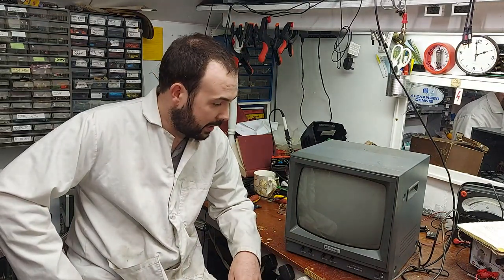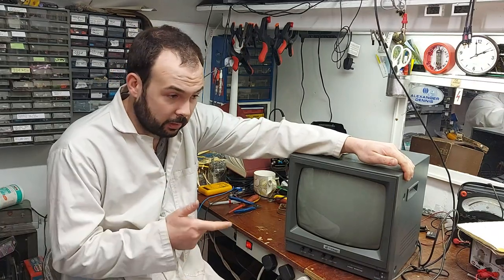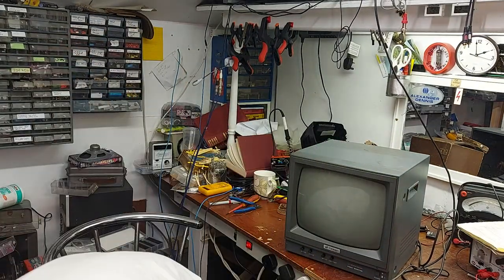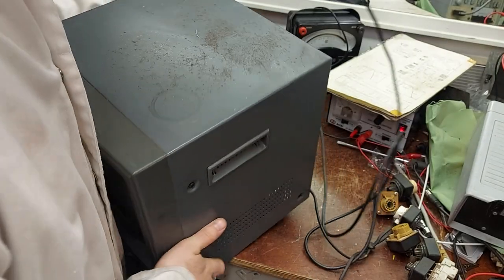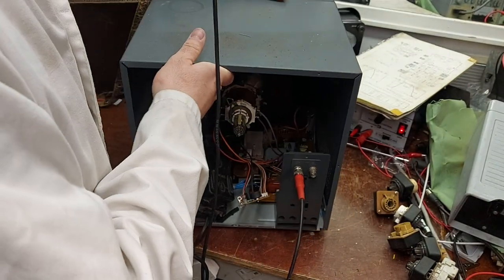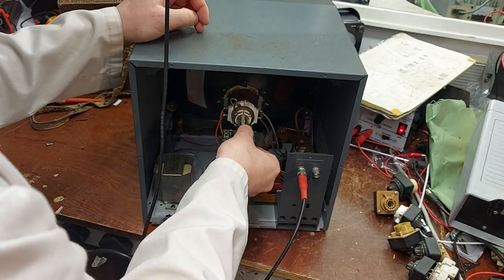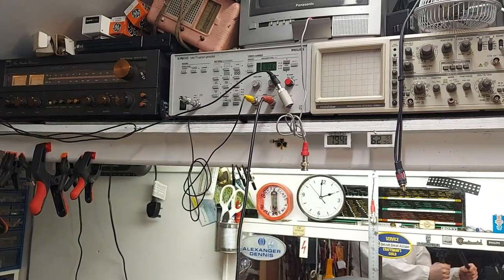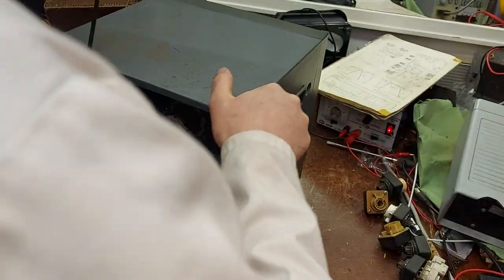Right, quick look at this Chinese monitor — black and white 12-inch CCTV monitor. The tube in this is as flat as a pancake and we're going to try and give it a blast with our little coning machine. I'll turn this on for you so you can see how bad the tube is. It's a nice little monitor — I was given this. It had been in a home CCTV setup and had been left on for years and years, and it just got to the point it was barely visible. I have the safe block connected to it because they cut the lead off, but not to worry. The video in here is coming from our lovely PM5415 pattern generator, and I'll feed a test card through that.